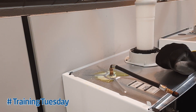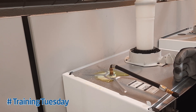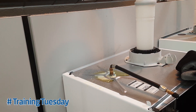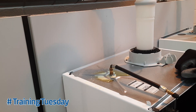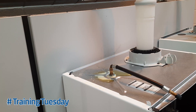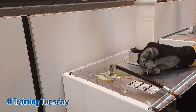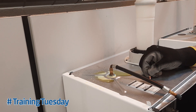I typically use these Schrader valve extensions for boilers like the Baxi Duotec, Baxi Platinum, and Potterton Pro Max, where the Schrader valve isn't external to the boiler — where it's internal, it's a little bit more awkward and the extension is easier to fit. What I'd normally do on an external Schrader valve is use a Schrader valve core. That replaces the Schrader valve internally and saves replacing a complete expansion vessel.